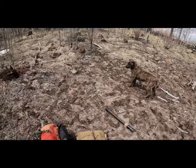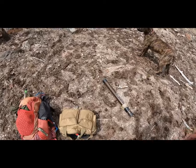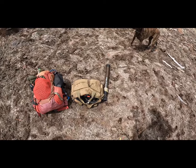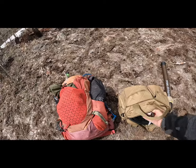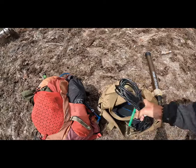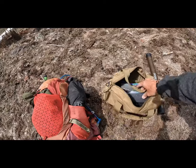Let's take a look at the station configuration here. I didn't zip the bag up, but it's about 13 extra pounds for this config. I'll be using a random wire today, and I basically built one using an LDG 9-to-1 Unun. So we got that baby in there. I grabbed some feed line because I forgot this the other day, so you could probably go with a lighter feed line.